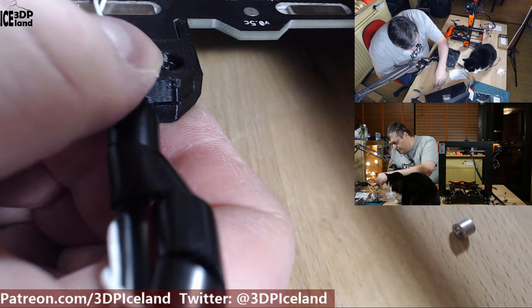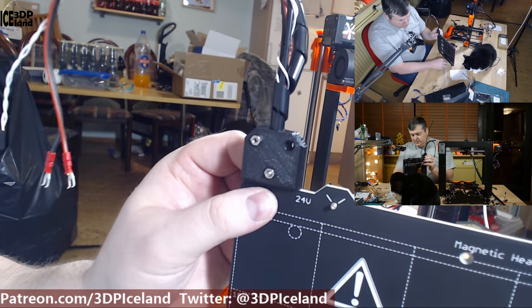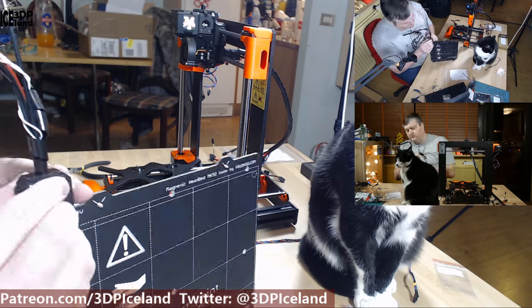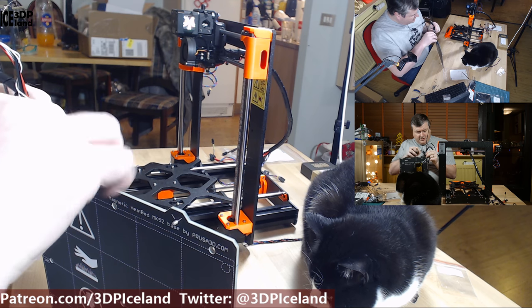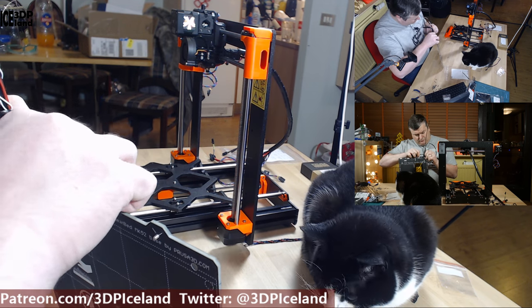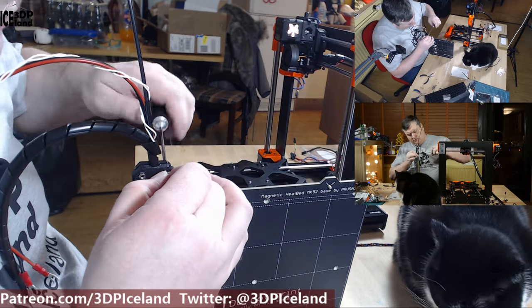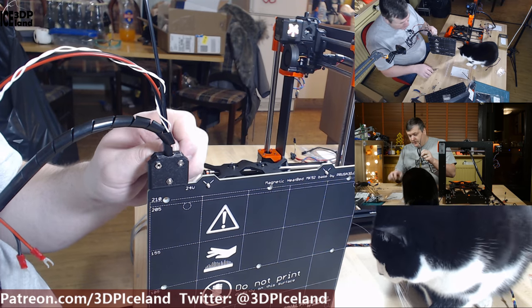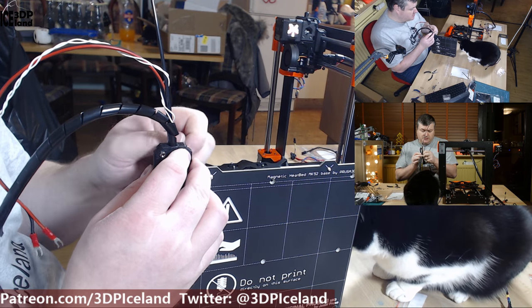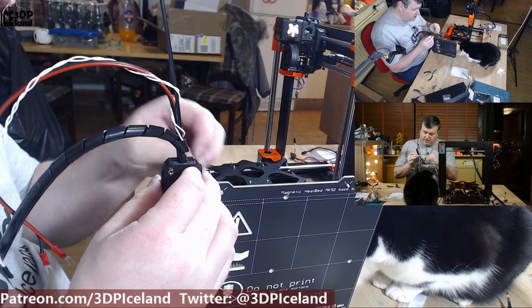Now place the top cover using 10mm screws. A nut fell out of place — I found it on the table. This gave me a little bit of trouble, so I'm going to force it in and use a longer screw to force the nut in. It is better to do it that way with a longer screw instead of using force with the pliers, because you can always break the parts with the pliers. With a longer screw the force is in the correct orientation.